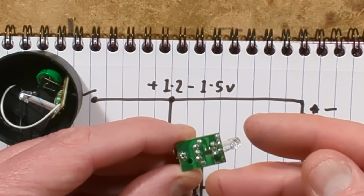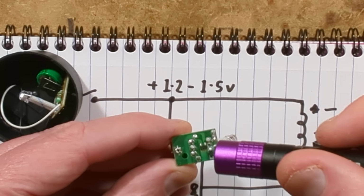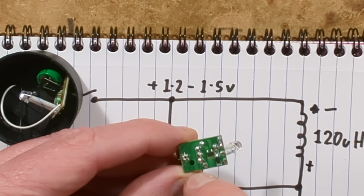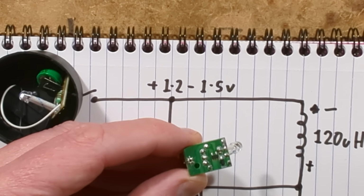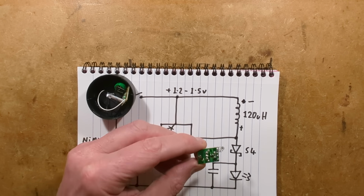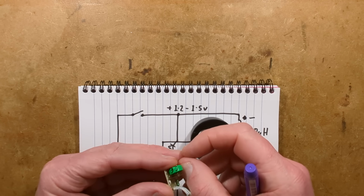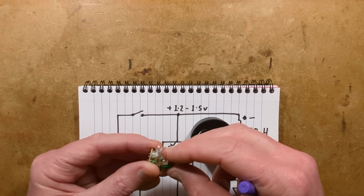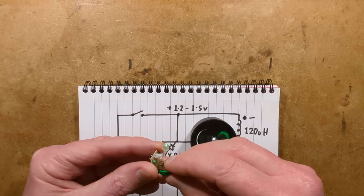It covers it. It's like those resin badges you get. And once you've covered it completely, just get your ultraviolet flashlight and just cure it instantly, and that should act as a barrier against water corroding anywhere that there's DC present in the circuit board, because DC in water causes corrosion. But that is it. They look sensible, normal little lights. Quite surprised at the little contact, the little tab approach for these, but it's just probably cheaper than using a switch, and the switches are also unreliable, but I get the feeling this is going to be unreliable too.